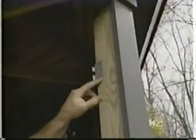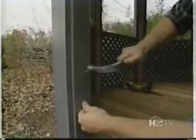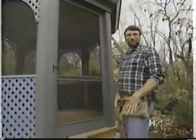Now on the hinge side of the door, I've already mortised some galvanized hinges into the post, but I need a piece of trim against which the door will close. Another piece of 5/4 up against the corner board. And on the latch side, another piece of 5/4. All the pieces will be secured with some stainless steel nails. Oh, all right, that should keep the bugs out.